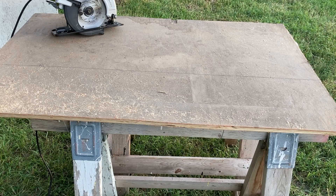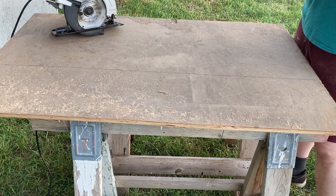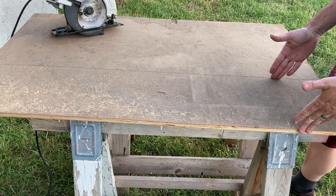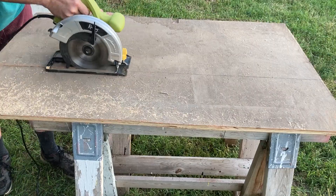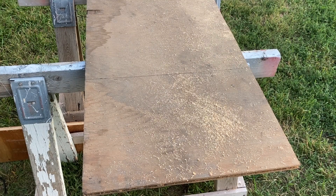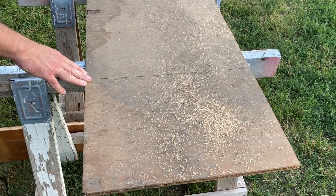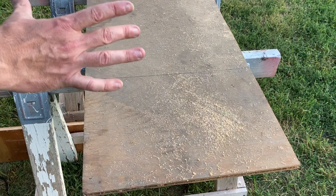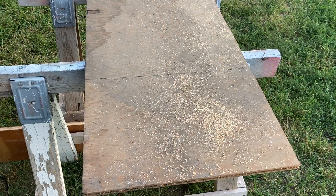The final long cut of the plywood is another 19 inches — this will be our base. We'll put big two by fours underneath it so you'll have a platform to stand on when compressing the hay bale, and somewhere for the bale to come out onto. From this base plate I'm going to measure 13 inches for our squisher head, then cut an inch off so it'll have a half-inch tolerance — this will be our top piece and we'll keep the rest as our bottom.